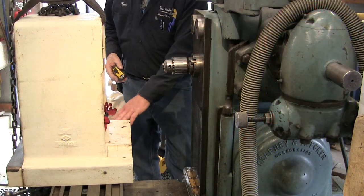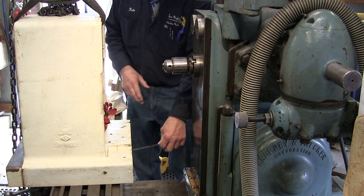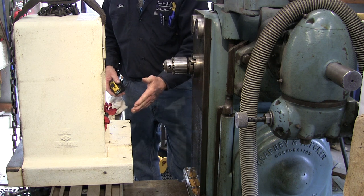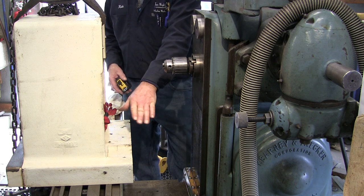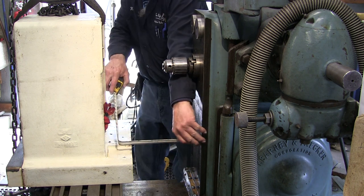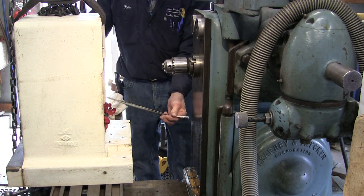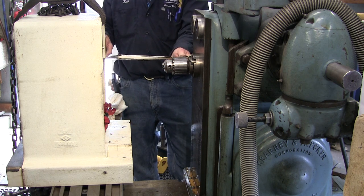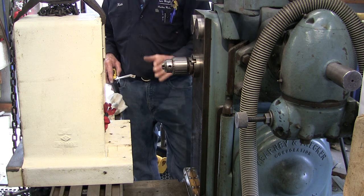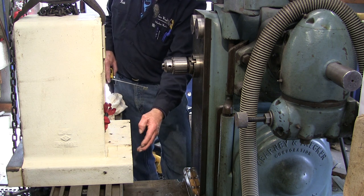All right, I got this setting down on here hard, and the overhang is probably about 1¼ inches or so sticking out, 1⅜ inches. And we don't know exactly, turning this, and that surface is kind of rough there, so we're just giving ourselves room. We look like we're pretty even within a 32nd of an inch here to here right now. And what I did is I came off the table here 9.5, and that's like 4¾ to 5, depending on where you're going to have the bit at. So that's going to leave us enough for the size drilling that we're going to be doing in here.